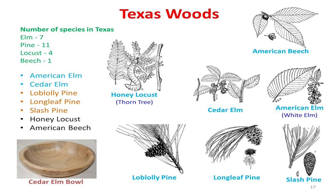We're going to talk about various woods most of you have probably never turned. Honey locust is our local thorn tree. If you're brave enough to go cut one, it's beautiful wood — you can see the pattern in this bowl. Honey locust is a beautiful wood to turn. Years ago they made thornless hybrids available in the nursery trade, so you can find them planted in yards. It's a great piece of wood — very stable, kind of hard, but very good.